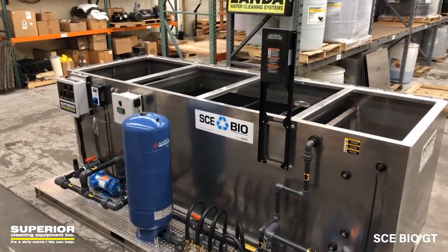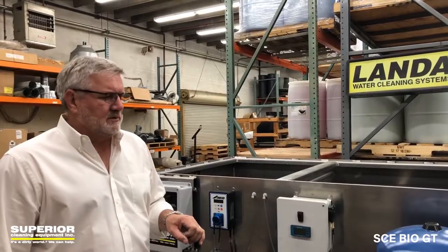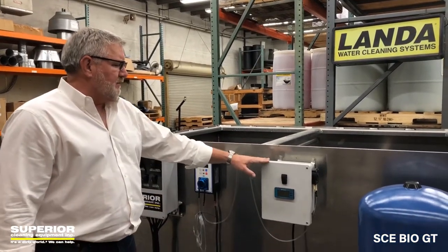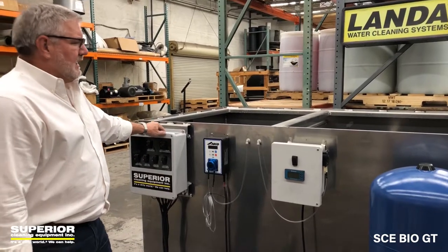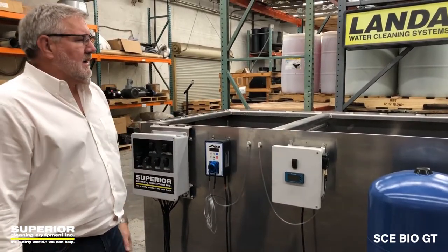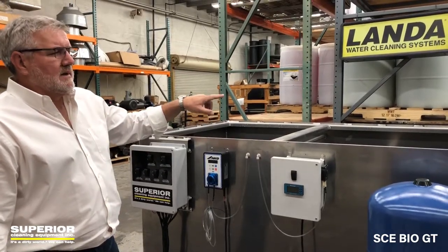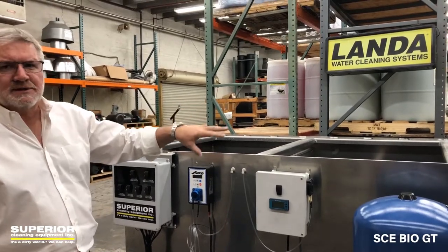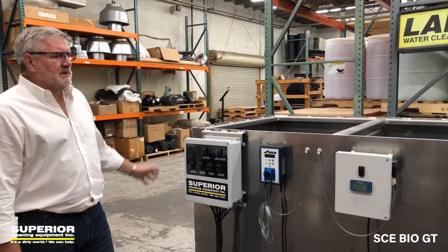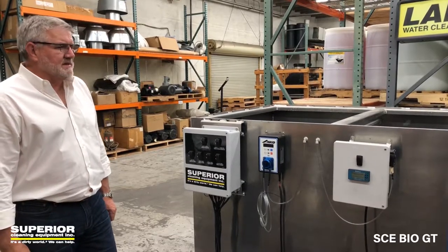It's a nice evolution of some of the stuff we've been doing. We wanted a system with heavier-duty components. I'm a big fan of totally enclosed fan-cooled motors. I like the skid-mounted application, and the techs like the fact that it's easy to service and see what's going on. We like the upgraded components on pH controllers, microns, and cabinets — and of course the aluminum or stainless steel. Not only does it look beautiful, but it performs wonderfully, aerating the entire first two sections of the tank. Of the 1,400 gallons, more than 1,000 gallons of that water is constantly being aerated and microbes injected. We can add chemical coagulation on the front depending on the waste stream, and we can also do some pre-treatment on the pit side or post-treatment on the exit side. What we've found is that the system does a very, very good job on its own.